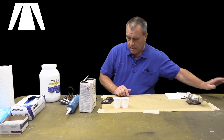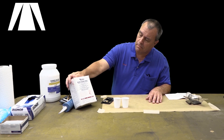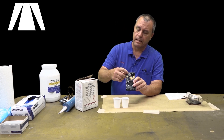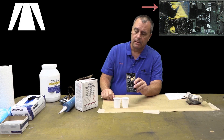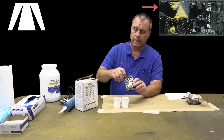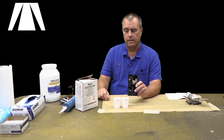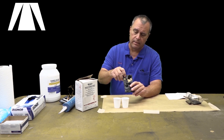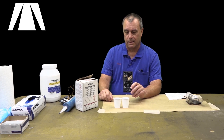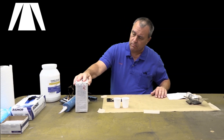First I started with the MG Chemicals flexible epoxy potting material. This is very common. It looks kind of shiny black. You can get it hard as a rock or you can get it flexible. The reason why you want flexibility is so when the components heat up and cool down they're allowed to expand and contract a little bit without being rock solid in plastic.